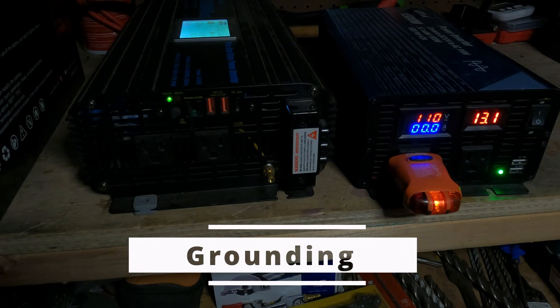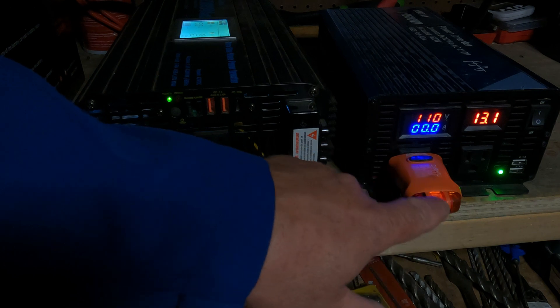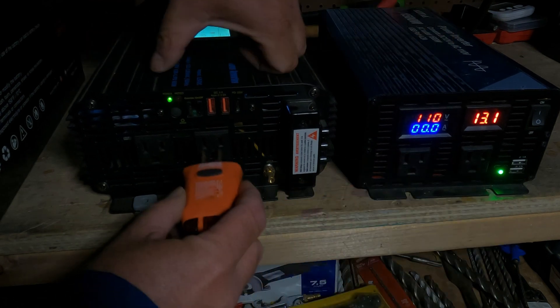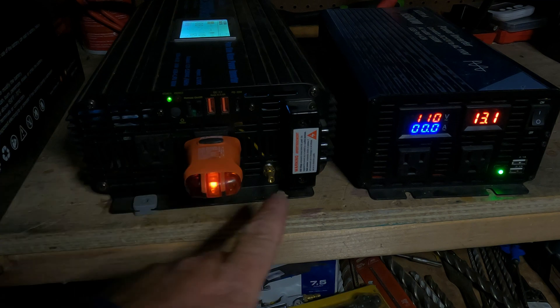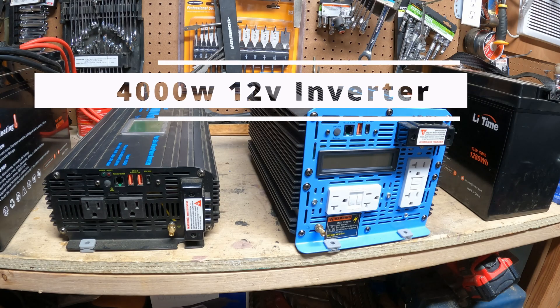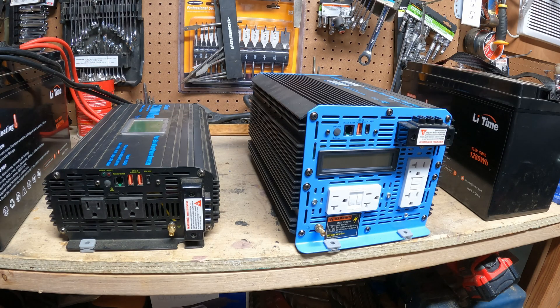Here's a slightly more advanced topic: grounding. On the cheap inverter, the tester shows an open ground with no grounding rod. The quality inverter also shows open ground in the tester, but it does have a grounding rod — just something to consider when building out your system. Also, while a standard rule of thumb is that 12 volts is good for small systems, you can get a 4,000-watt 12-volt inverter, but it comes with drawbacks — most significantly that it will push over 300 amps, requiring massive wiring.